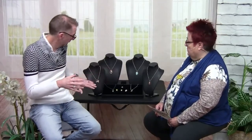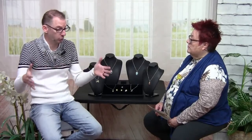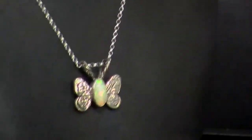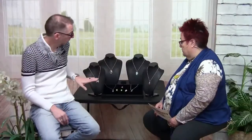So in the case of these, you work this in your machines as well? I do. Explain to us exactly what lapidary does. So with lapidary, you're taking a piece of rough stone, you are shaping that into a piece that you want. And with any of the stoneworks, there's a couple different things you can do. A lot of the techniques is you cut it into what's called a cabochon. You'll have a flat bottom and a domed or an angled top on the stone. And so you have a particular machine with wheels or flat discs that you'll use to grind and shape that material. Faceting is something that I want to learn to do. Expensive, even harder to find the instruction to do that. But these are all done on these lapidary machines.